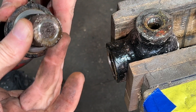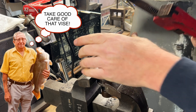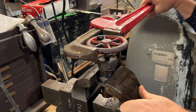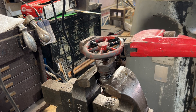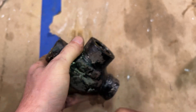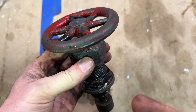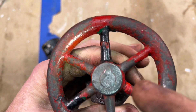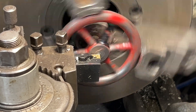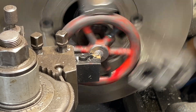Look at this — this is a different kind of valve here. I got this locked up in the Charles Parker and I'm going to attempt to get onto this handle. That's moving — nice. So we got flow coming in one side, comes through the top, and then out over here. You can see this right here is machined to seat down right on that. I want to get this handle off — they've got kind of a pin in the top. I'm going to put this on the lathe, skim this off, maybe drill that out, get this handle off, and get this whole assembly apart.